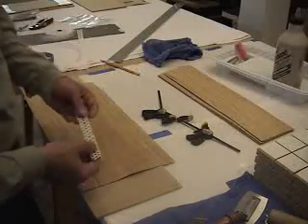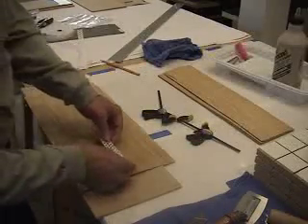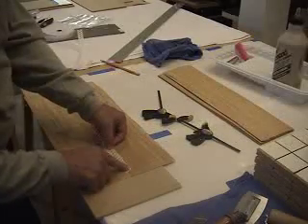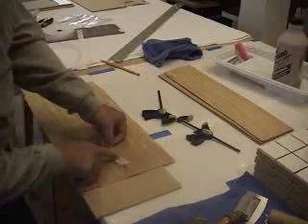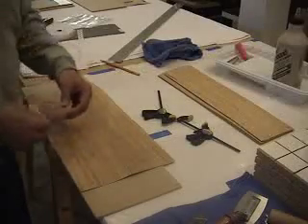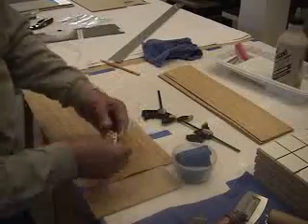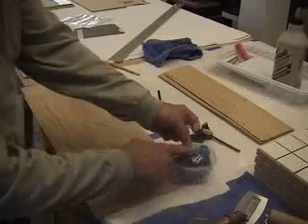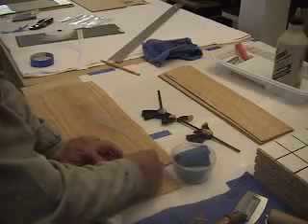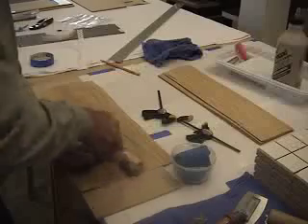This is three-hole tape. The series of larger holes down the center is used to help line up the tape on the center of the seam, so you can see just a hint of the seam and line up the tape accordingly. I'm using a small cup with a sponge, tearing off little pieces of tape, getting the tape wet, and applying it the same way — except it's fragile so I'm not pulling on it. Then you just run it down with your seam roller.